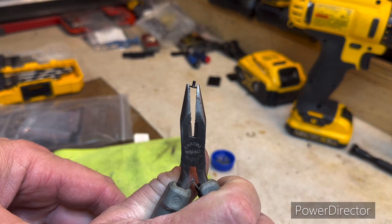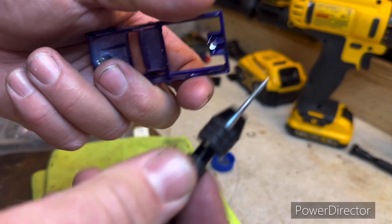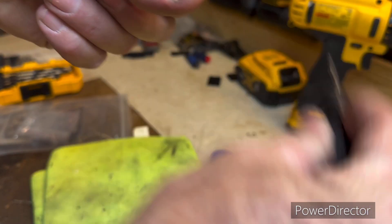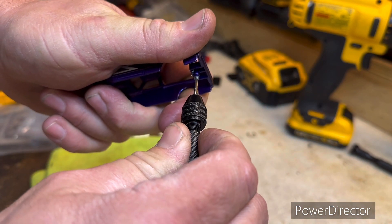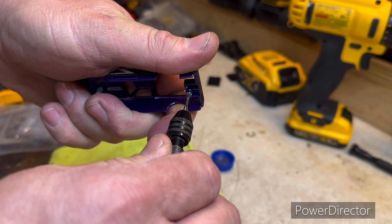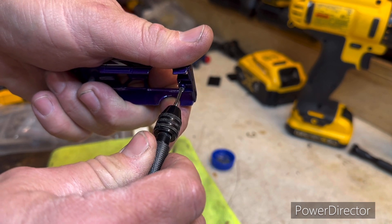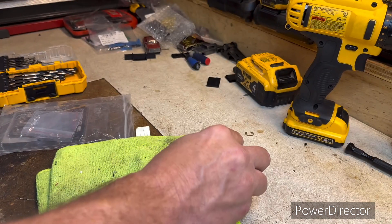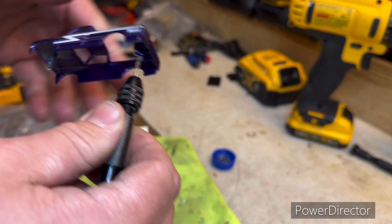There's all the screw we're using, so we drilled plenty deep enough. Same thing goes when putting the threads in — a little WD-40 on the end. I like to use these versus the T-handles because there's less wobbling. Turn a few rounds, back it out, clean it off, repeat. You can feel it as it starts to cut and gets a little tighter. Back it out, clean the threads. Take your time — it's almost about to bottom out. This one has got a sharp point on it. You can feel it tighten up — quit right there, that's plenty of thread.